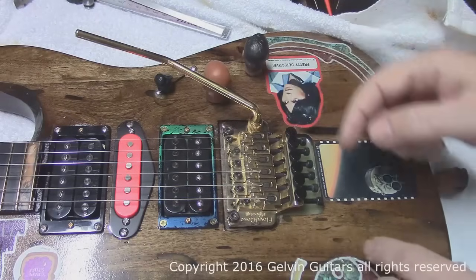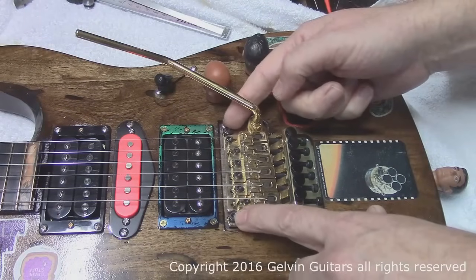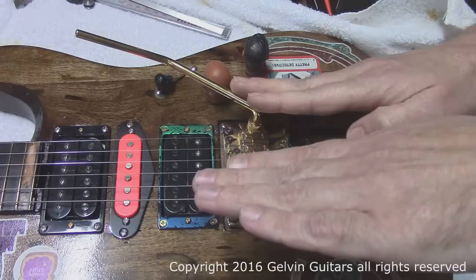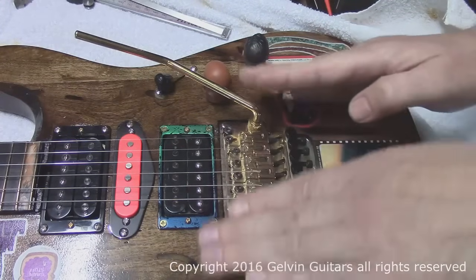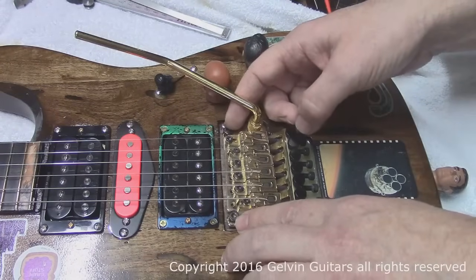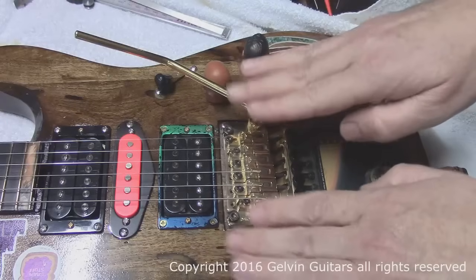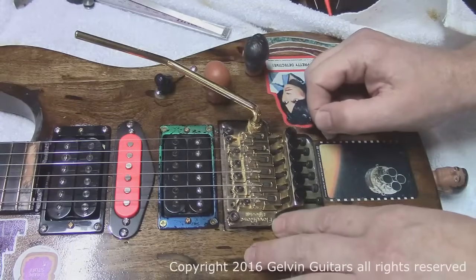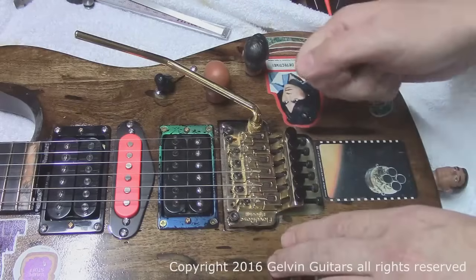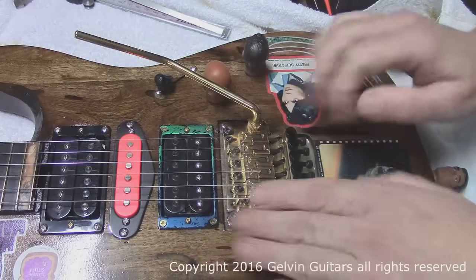Now, it's important that when you do that, these guys are fairly close to being the same. You wouldn't want this thing to be tilting like this, like extreme, because you should never have to do that. But if you ended up doing that, it would kind of jam this thing, and it would lock in and have friction there that is unnecessary, and it could make clanking noises. So try to get them fairly close to the same height.